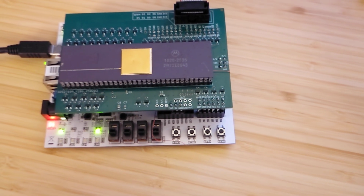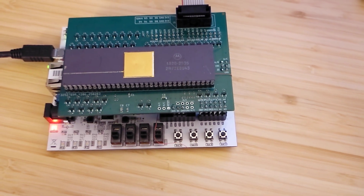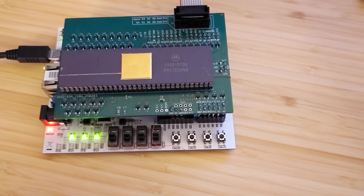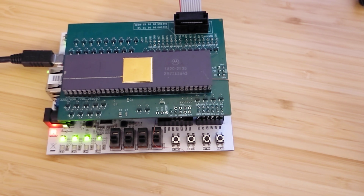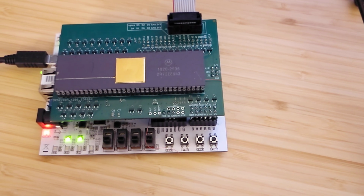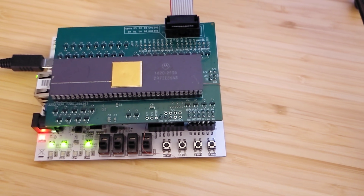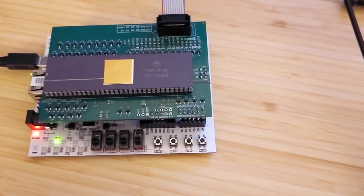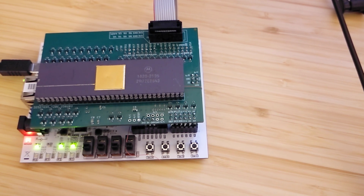Oh, and the program is written in C, compiled with GCC for M68K, and I stripped away everything, so I'm using my own custom linker script and no standard libraries. So it's just compiling C code to 68K machine code and linking it with the very bare minimum.